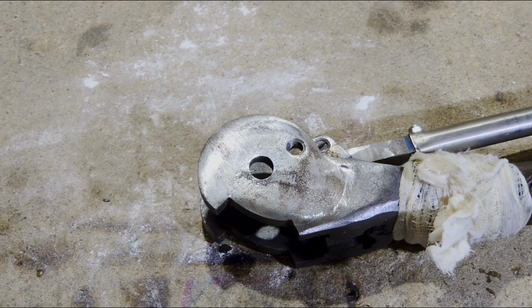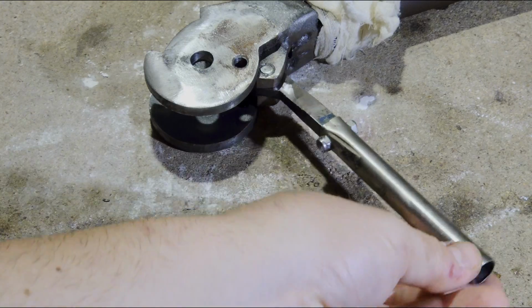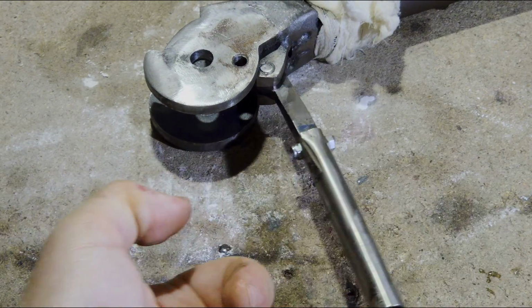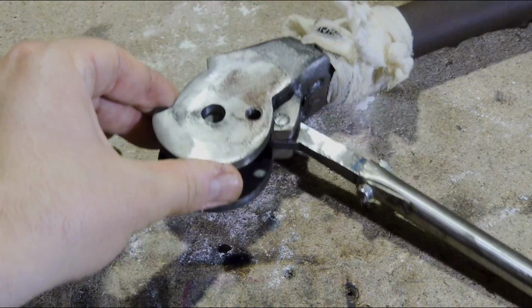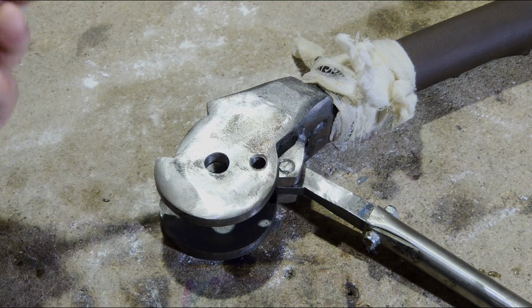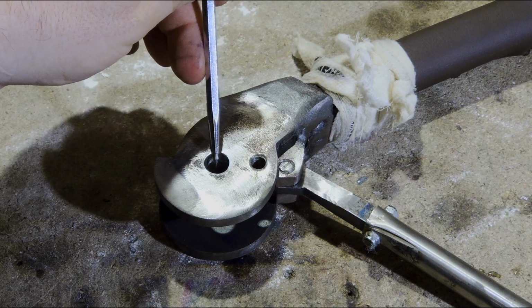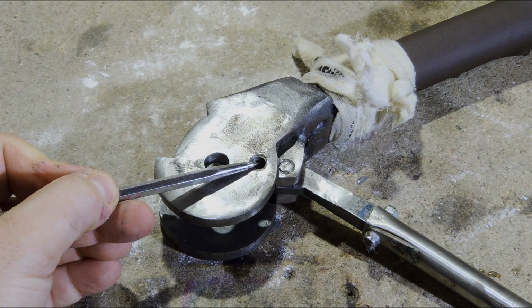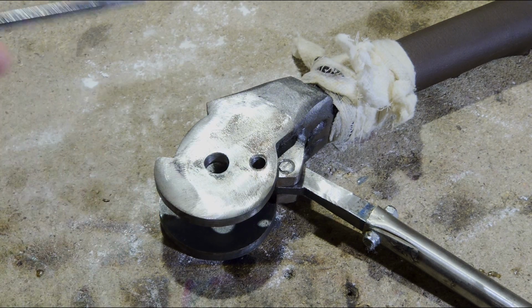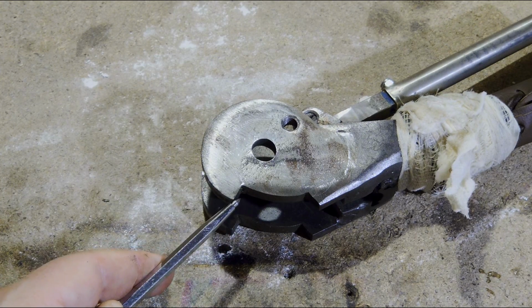On the other side of the lower handle half we have this contraption. First off, you can see here the one half of the piston I showed you that runs through the main spring. Very important is the distance between this point of contact and the middle point of the axis, because as you can see, if you make the distance too short, it won't work. Now the other important technical elements are those surfaces here and down here.